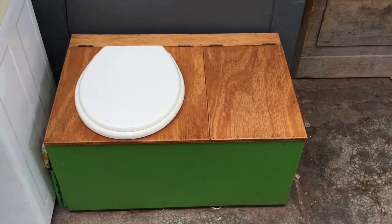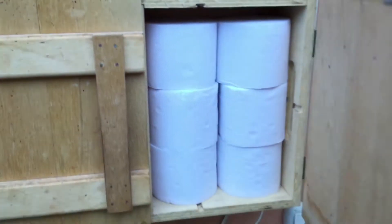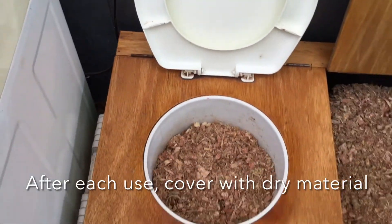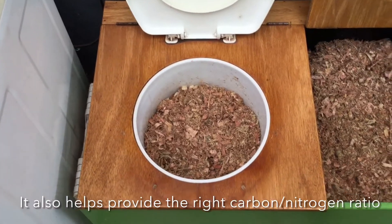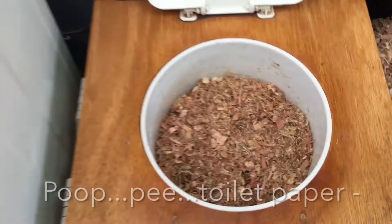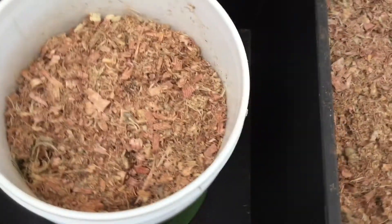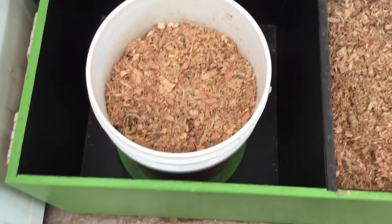This is how our compost toilet works. I built a plywood box for it, and above it is a quick cabinet that holds toilet paper. On one side there's a compartment holding all the wood shavings. Inside the box, I cut a circle that fits the bucket accurately to cut down on urine spillage, keeping everything much cleaner. The bucket sits inside the box on a plywood ring screwed into the bottom, which locates the bucket accurately so you're not fumbling to line everything up when it's time to change the bucket.